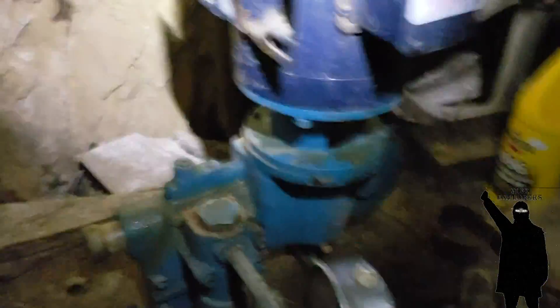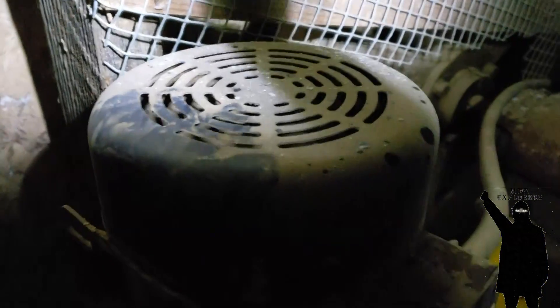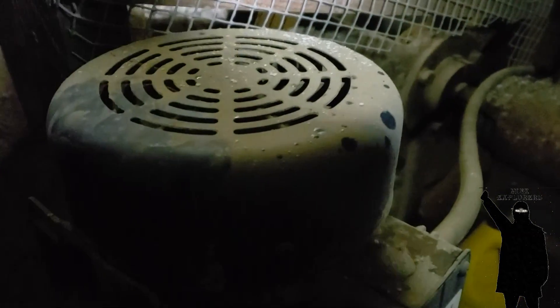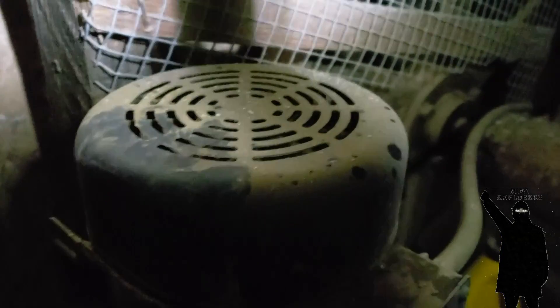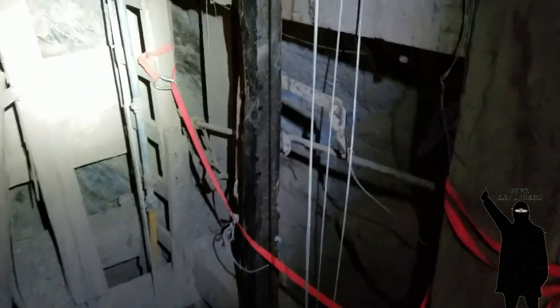I'm going to say this pump is good. The way I'm coming to that determination is I'm turning this counterclockwise with my finger here — this is one hell of a gear reduction. You can see it hit pressure where it's trying to compress the water, and of course I can't turn it by hand. Pump is good.